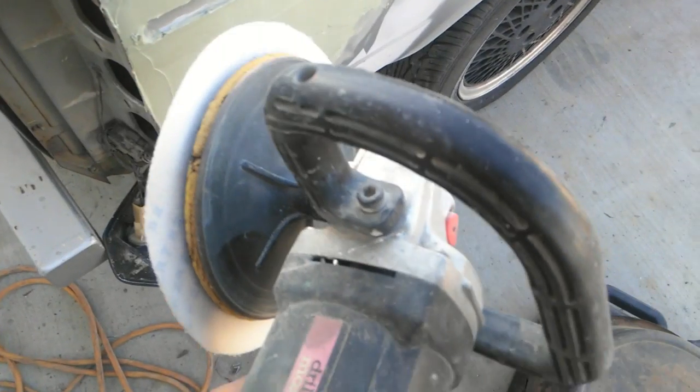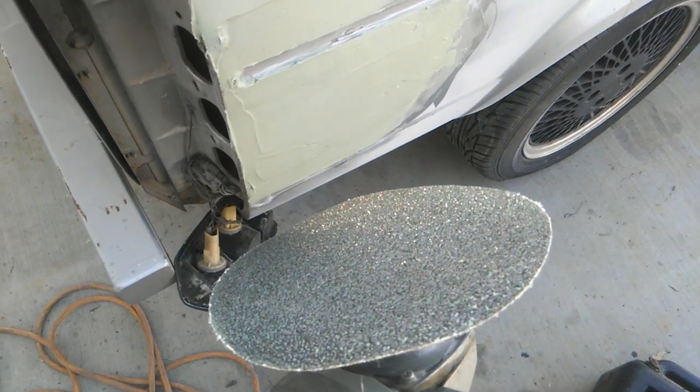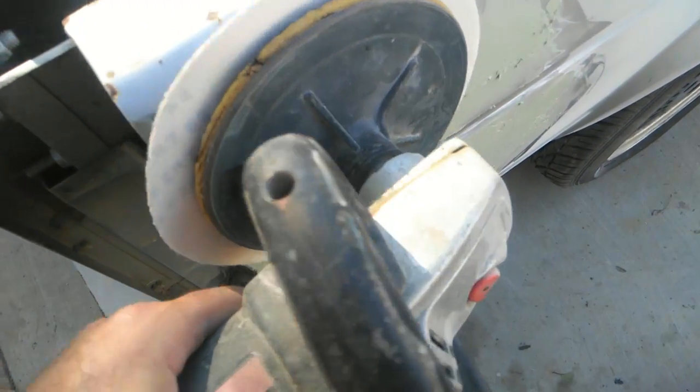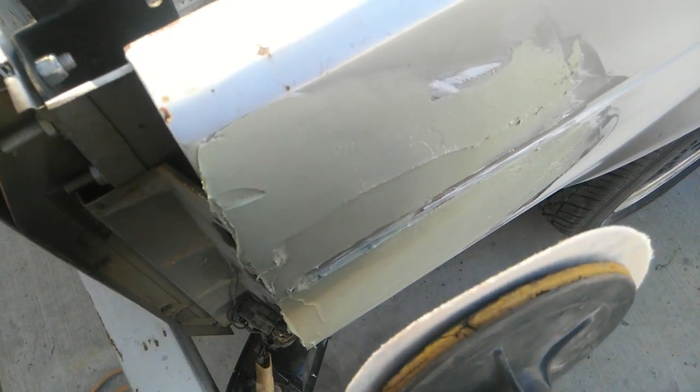What I'm going to do — this is a polisher, not a grinder, slower speed. I take this and I'm going to hold it on here flat. You can't hold it at an angle like this; it has to be flat. I'll shape this with 36-grit and then switch to 80.